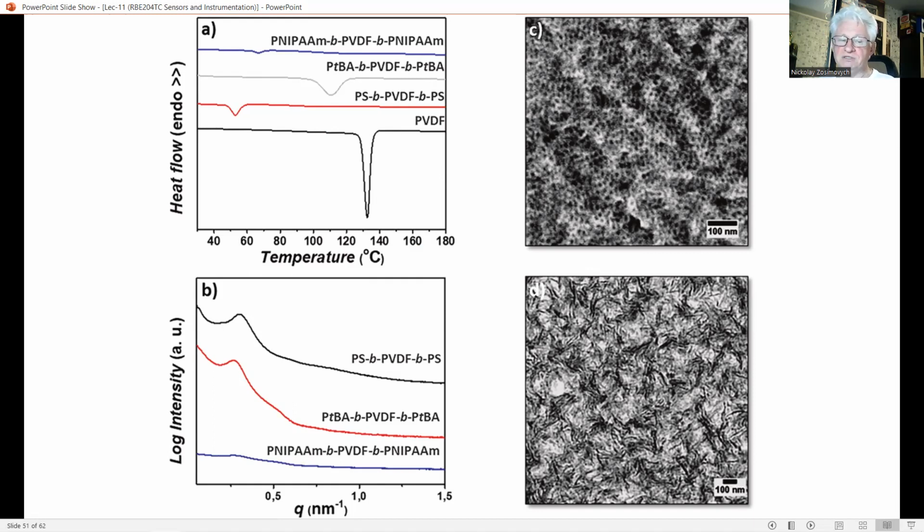The major advantage of polymers over ceramic materials is their flexibility and small size, with sheet thickness of several micrometers. Another development concerns the deposition of thin film ceramics. This technology too can benefit from compatibility with integrated circuits and using the reversibility of piezoelectricity for microactuators. The primary output quantity of a piezoelectric sensor is charge. A bit later, we will show two basic schemes to convert the charge into a voltage, with a very high load impedance, like open terminals, and with an almost zero load impedance, short circuit terminals.